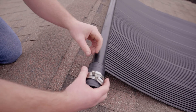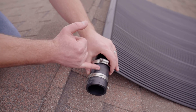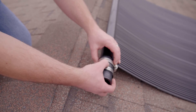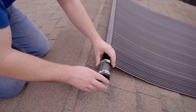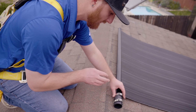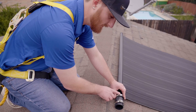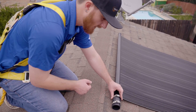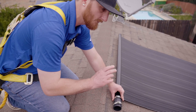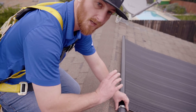Wedge the rubber coupling right on the end of the panel until it stops — there's a stopper in the middle of the coupling that only allows you to go so far. Make sure you're fully butted up against that piece. A tip for easy installation and future servicing: tighten the hose clamps facing outward toward you and always pointed straight up, so that over time the expansion and contraction of the rubber coupling doesn't cause the hose clamp to spin.